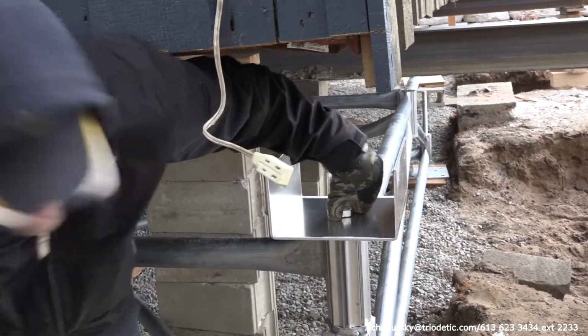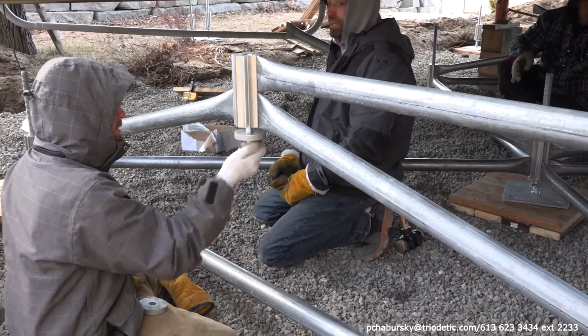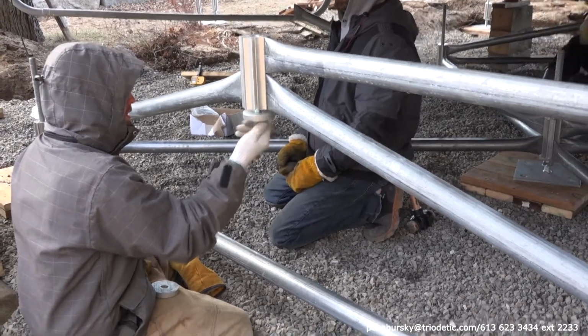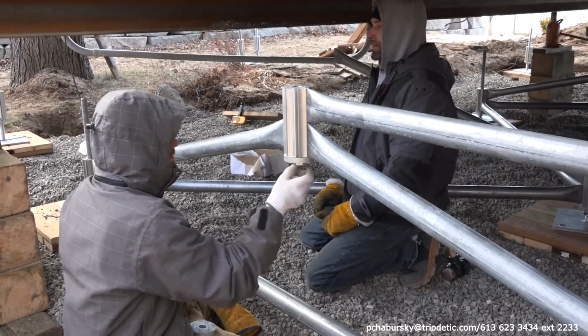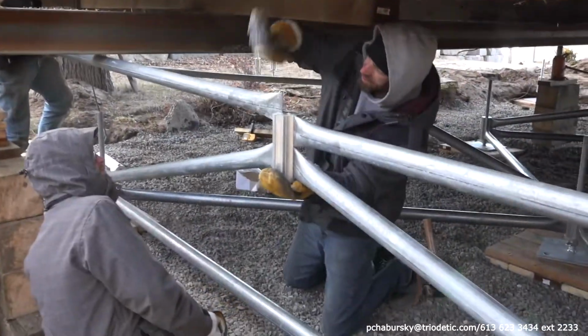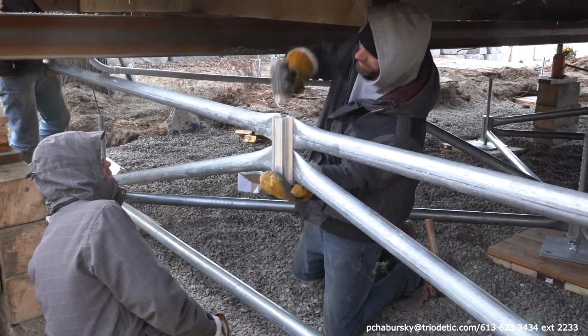This process of putting saddle brackets, plates and bolts is repeated throughout the modules as you move along, as you keep placing and connecting the tubes to the hubs. Just follow the same procedures over and over. Make sure, again, everything is level and square. It will make the installation much easier for you.